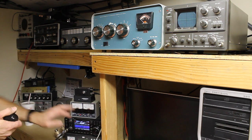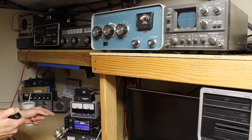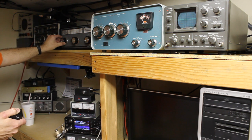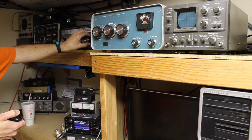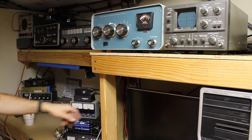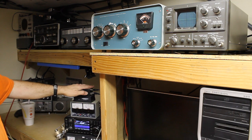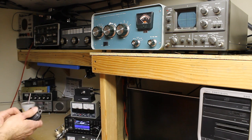You need to be on low power — I'm on 10 watts. Go ahead and key, and if you have a manual tuner you would adjust it to get minimum SWR and maximum power output. That's with the amp in bypass of course. So now we're going to engage the amplifier.